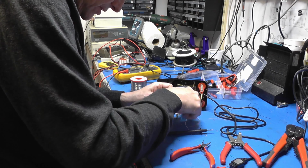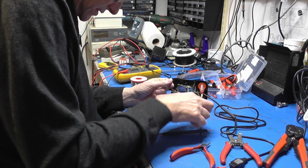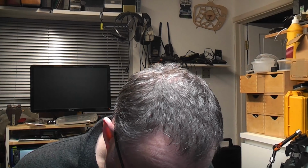We need to cut the other 3 off, because they've got input A, which is for paddles, input B, which is for paddles, and 5 volts, which is also used in the paddles, or on the Quickshot 2 auto fire function, or any other joystick's auto fire function, unless you had an Amstrad CPC, because the Amstrad CPC didn't bring the 5 volt line out to the joystick port, thus disabling your auto fire shenanigans. Very sad.